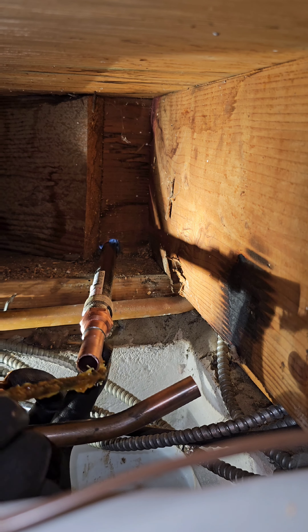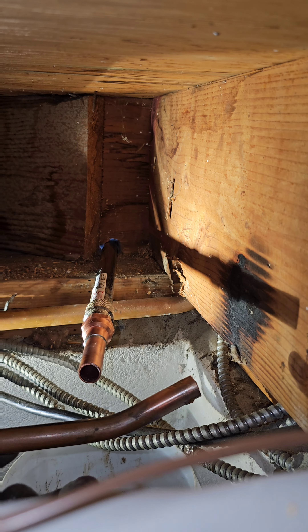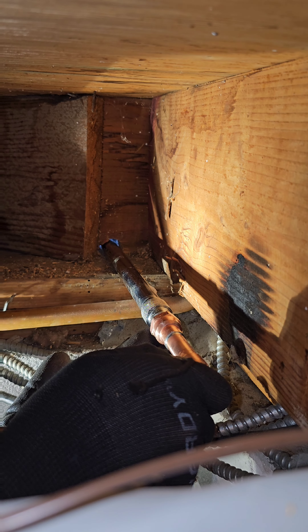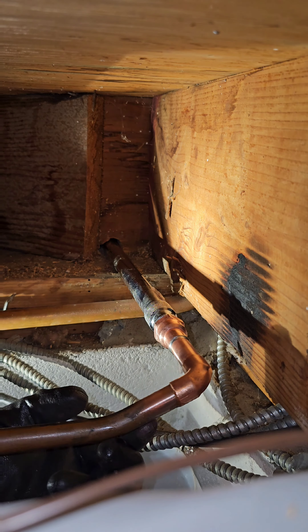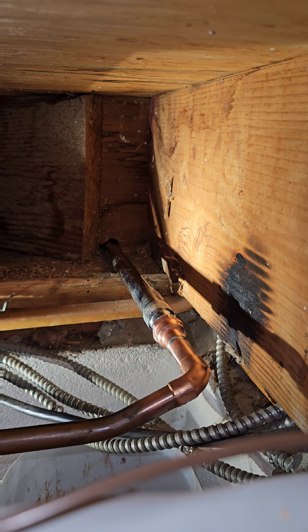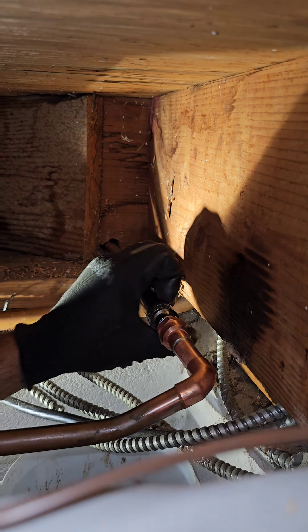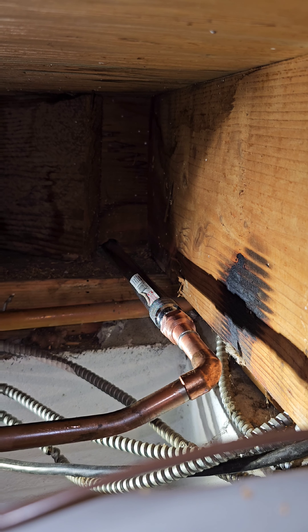Sandpaper or emery cloth - scuff up the pipe so it's nice and clean. My standards are pretty high so it takes a little while. Put some flux around the pipe, put some flux inside the fittings, and put everything together. I'm lucky this frost-free only needs one fitting soldered - two joints, nice and quick. This is a real tight spot; I'm on my back right now, sweating with no air conditioning in this basement. My guy's outside moving it left or right to center it, and he screws it in once it's positioned.